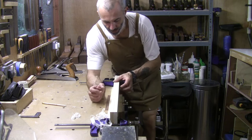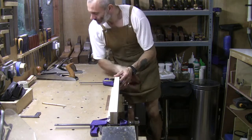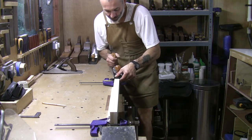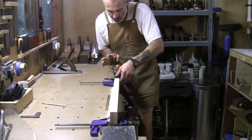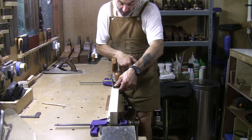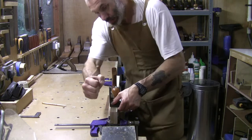One thing I found, this is now jointed, and I'm going to check in a minute, right in front of you, so I hope it's all right, is that generally speaking, when we're planing, especially with a metal plane, but with any plane, as soon as we are just about to engage, we really need to take the pressure down here without putting any weight, as I mentioned. And as we go, as soon as it engages, then as soon as this hand is directly supported by the wood from the plane, then we can apply an equal amount of pressure still in that direction. This is what I'm imagining to basically do this motion.